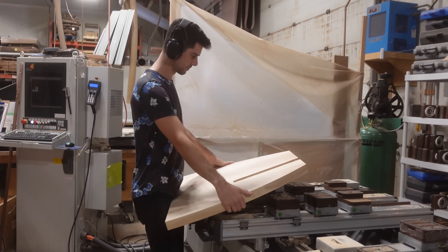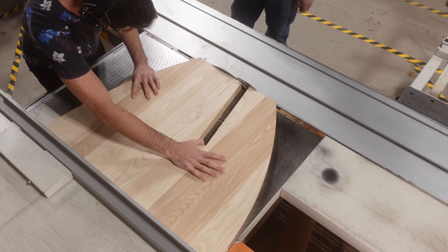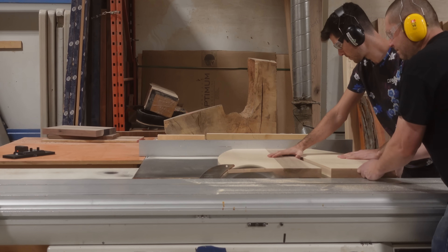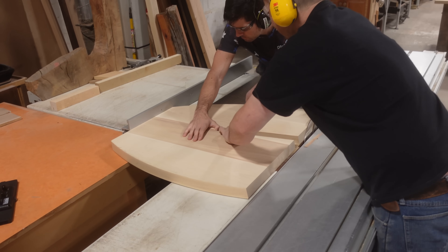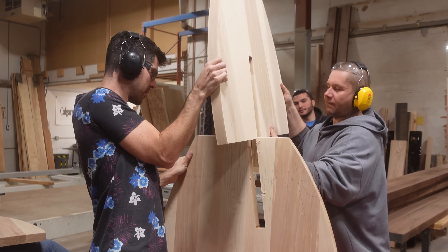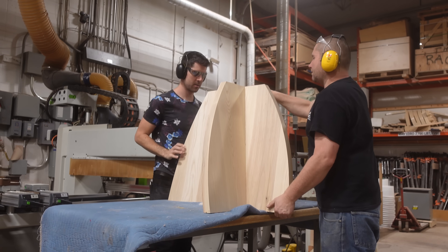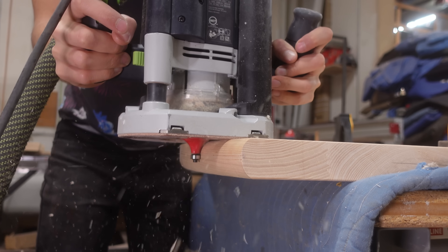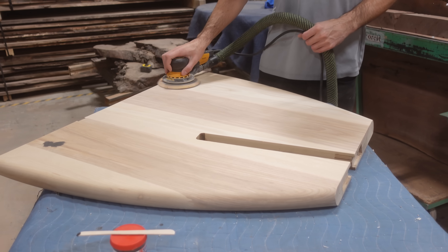With one of the half lap pieces put together, we now have to cut the angles that allow these pieces to sit the way we want. Even though the cuts are perpendicular to the surface of the pieces, the client doesn't want either of them sitting straight up on a 90-degree angle to the floor, so we had to calculate the required angle on the top and bottom of both pieces to tilt them just enough. Like the tabletops, these bases are also going to get a round over to help tie all the details together, but we're leaving the bottom flat for a larger surface area touching the ground and to have room for the protective felt.